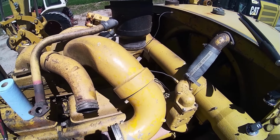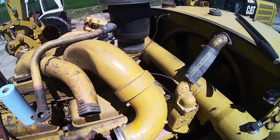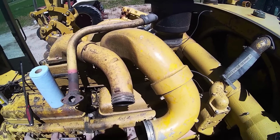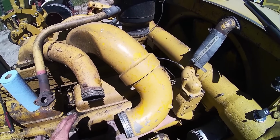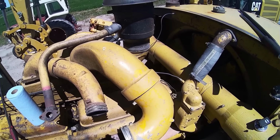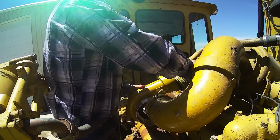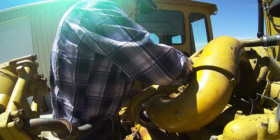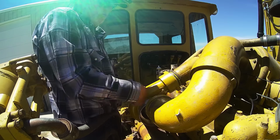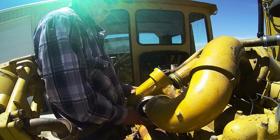So I can put this compressor housing on, then I can slide the cartridge in and orient it for the oil lines, snug it up, then put the exhaust housing on. Boy, oh boy, oh boy, I don't know. I do not know. This is gonna work.